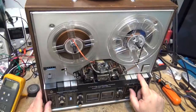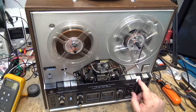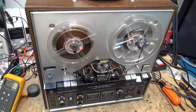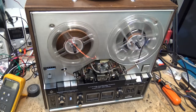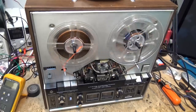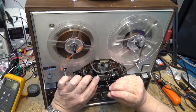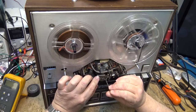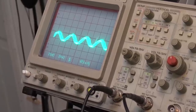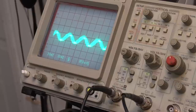Okay, we have power. Tape speed: seven and a half. Oh, I hear an awful lot of wow and flutter on this thing. For a machine with new pinch rollers, that's a lot. So what I'm doing here is adjusting the azimuth here to align the phases up.